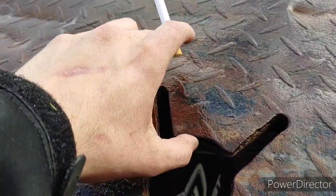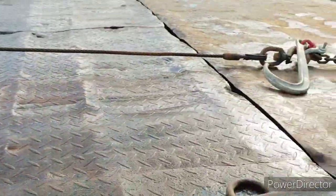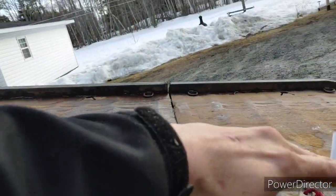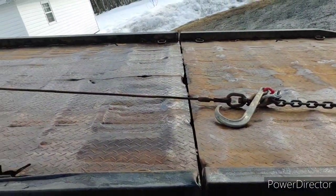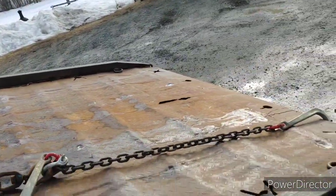It's quarter inch, then three-eighths underneath it, and then there's going to be a quarter inch and a quarter inch, so that should stiffen up the bed. I'm gonna stop it from tilting in the middle — this bottom piece kicks out when you put it on the ground. I'm gonna get rid of that, make it one solid piece, and weld a strip up the middle just to stiffen it all up.